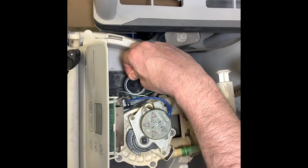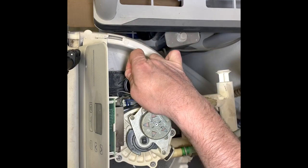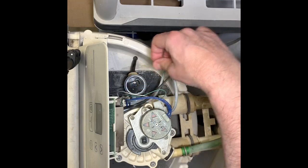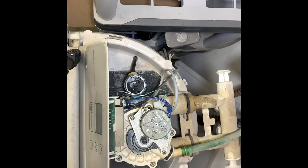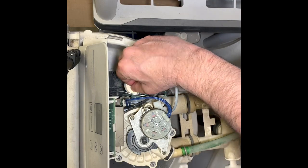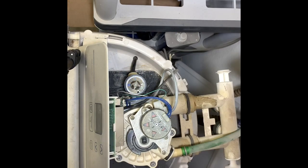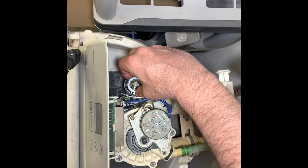Of course it doesn't want to go in, right? I didn't use that nail to touch the diaphragm — I just want to use it to place that screen. That looks good; you can see the pass-through is lined up. Next, the venturi and the nozzle go in — this is actually the venturi and the nozzle right there. Again, the tooth and the screen facing up, and the screen retainer with the O-ring facing up. You could put some plumber's grease on that O-ring if you wanted to.